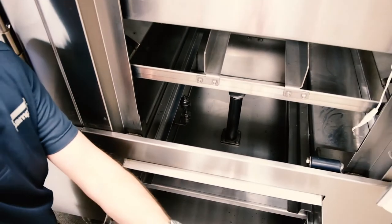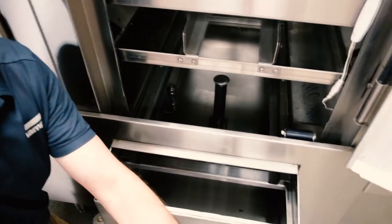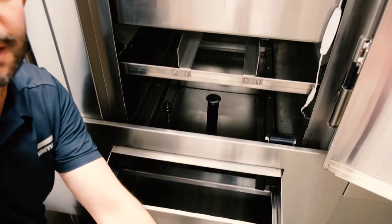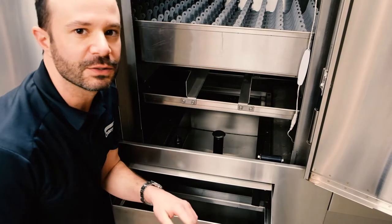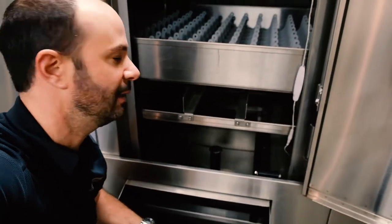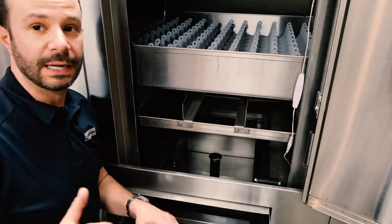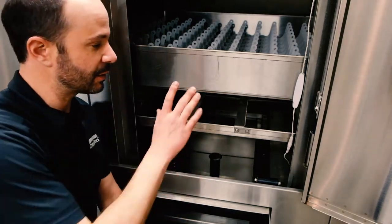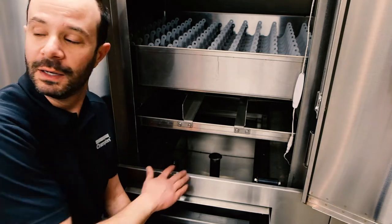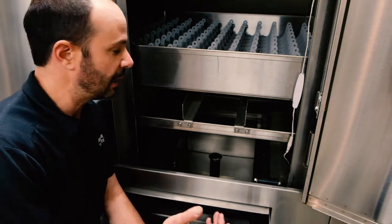Once I've pulled out my pump intake screen, addressed my floats, taken a look around inside, and sprayed everything out to make sure it's nice and clean, the next thing is to give it a general inspection inside the tank — make sure everything looks nice and shiny and nothing has built up. At this point, I'm going to take these items for the pre-wash tank over to the sink, clean them up, and then we're going to reinstall them.